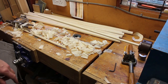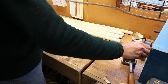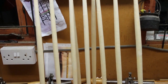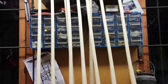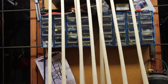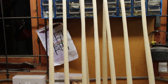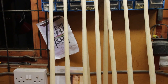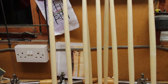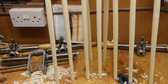There we have it — one nice spindle. I've left excess wood at each end so I can tweak it around when it comes to fitting and then trim them. I've got the spindles made up now and I've just been placing them into a sort of possible design to get a feel for what they're like. When I come back to the spindles I'll go over them with a curved scraper to get them nice and smooth so when they catch the light they look good. I'll obviously be trimming them to length as well, but for now that's the spindles made and they can be seasoning — I'll put them in my airing cupboard to warm up. Hope you've enjoyed watching this one — thanks again for watching.